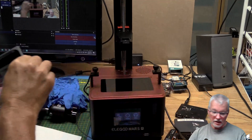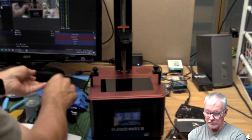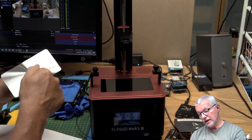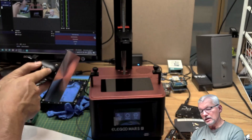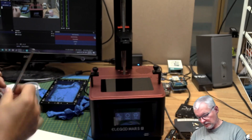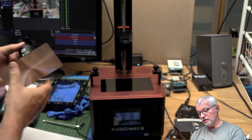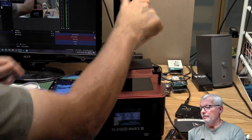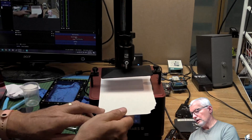I have already removed all the plastic film from this stuff. We put the build plate on — it's an aluminum finish, looks like they put it in a lathe and turned it. We need to slacken these two allen bolts so that it's a bit loose. Once they're loose, there is a bit of spring pressure on here, which is good because you want that. There's a notch here — just go straight onto the mounting bracket, screw it down tight.